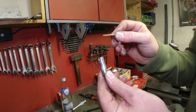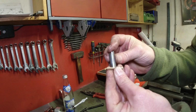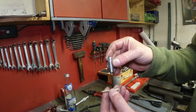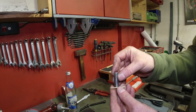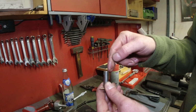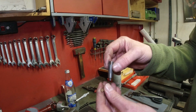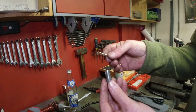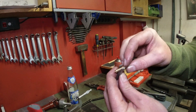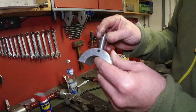Okay, and that is really easy. When you machine this piece first, you put this underneath this piece in your vise and use it as an end stop, and then you set it up in your vise and you clamp it. So if this is lying flat in your vise, you set this on top and you clamp it, and that automatically gets you the correct angle, and then you run an end mill here in and out, giving you the 5mm slot, and you're all done. So then this piece is by a hundredths of a millimeter in the correct angle mating to this piece. And you can see this also serves automatically as an anti-rotate by going into here.